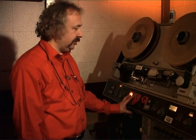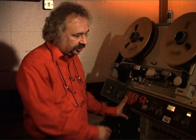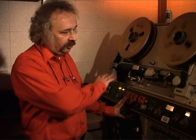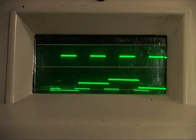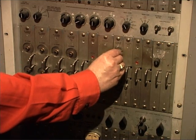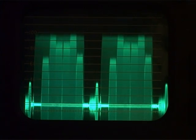These circuits affect the colour parts of the picture and we need to make adjustments on each channel to compensate. There is also a circuit called the autochromer which keeps the saturation the same if the signal coming off the tape should vary. The first adjustment is to get this circuit in the middle of its range. Looking at the yellow bar, you adjust the master equaliser - turn it fully anti-clockwise and bring it up slowly. The level of the yellow bar should rise quickly, dip down, and rise again, and the bottom of that dip is the correct setting.